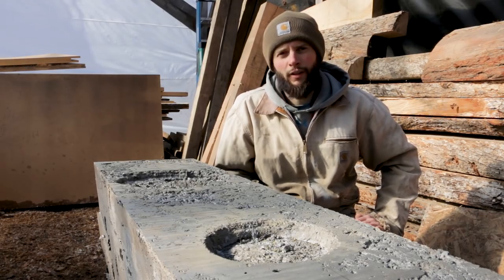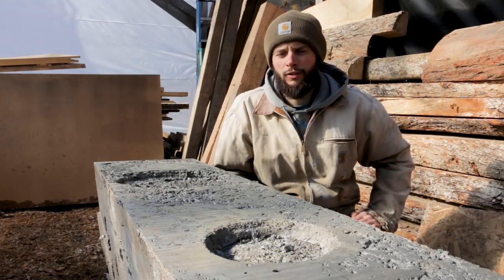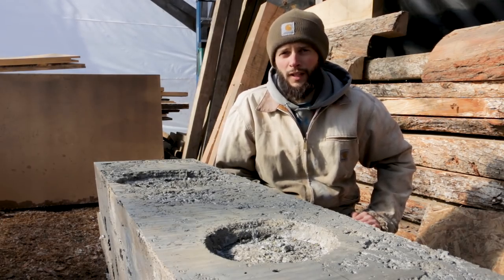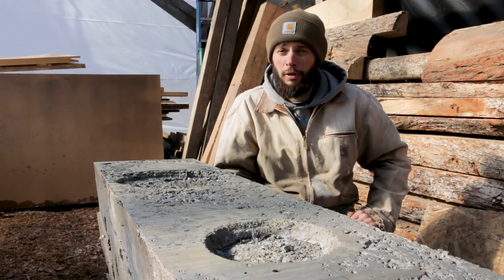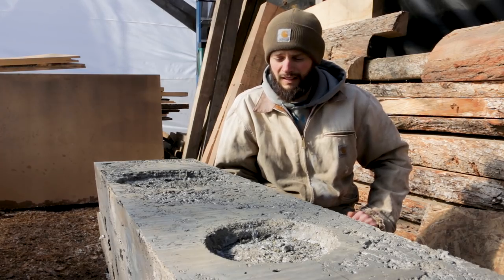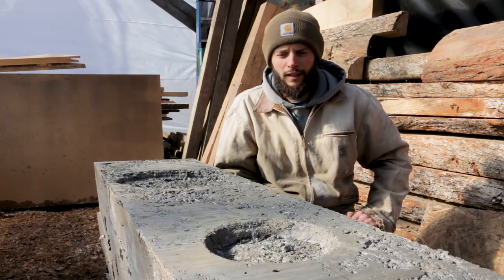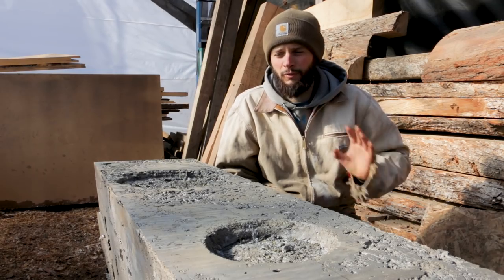A little bit earlier I pulled the measurements off the lofting floor, drew in a center line, plotted all the stations, and checked that the widths of the lead keel ended up where they needed to be. There's a little bit of guesswork with the shrinking of the lead and the charring of the mold, and it seems like we got that guesswork pretty much right. The keel is a quarter inch shorter than it's supposed to be, which is no big deal. Width-wise, which is the most important, we're pretty much spot on. We're just waiting on some paint and epoxy to be delivered and a warmer day to finish this up.